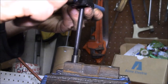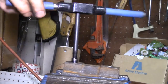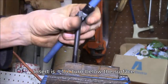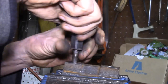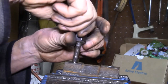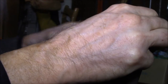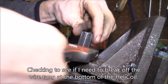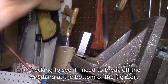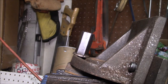Got the helicoil onto the mandrel here. Let me get my smaller tap wrench on there and just wind her down. I think that should stay in there — I guess that hits the bottom. I'll just screw that in there and see if that'll tighten up. Oh yeah — I don't think I have to do anything else in there because there's enough thickness. I'll just leave it like that.